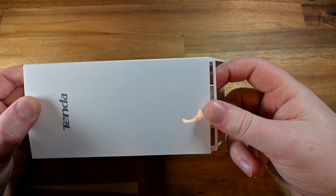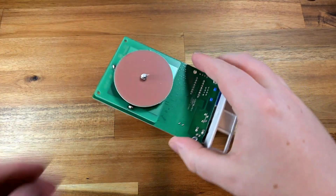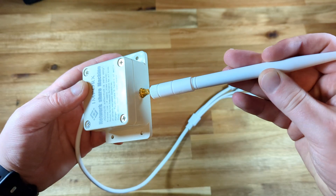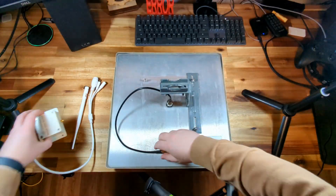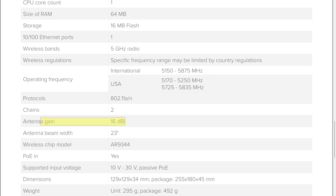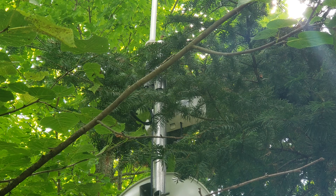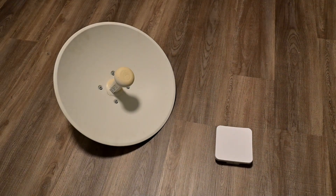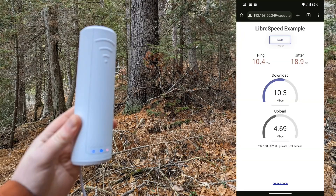The next thing to look at is the antenna. Many bridges have a built-in antenna of different shapes and sizes, and some have no antennas, leaving you to buy and connect a separate external one. At shorter distances under a kilometer with a clear path, you'll typically be fine with the smallest antenna available — under 16 dBi of antenna gain. If the signal has to pass through some light obstacles, going to a larger antenna could mitigate some signal loss, but performance is difficult to predict with an obstructed path.